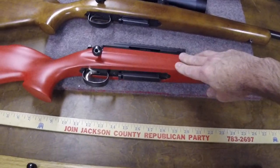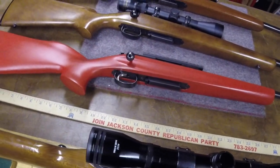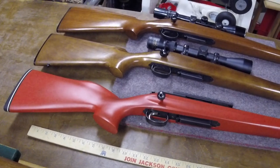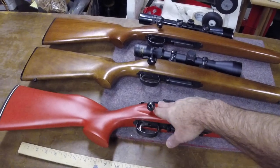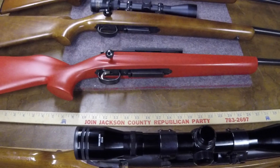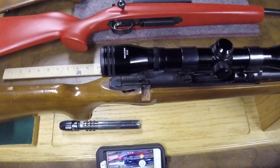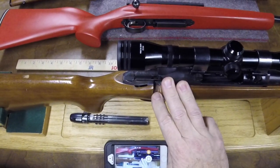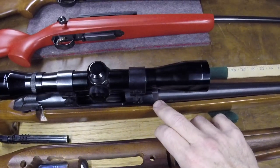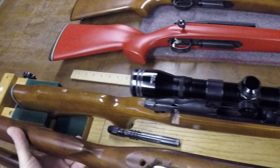I always figured I would carve on this stock a little more — thought about putting a flat bag rider on the front and maybe changing the shape back to make it ride in the bags better. I looked at several alternatives for aftermarket stocks and didn't find anything I really liked. I was pretty much of the opinion that I would buy a Remington 700 stock without the action inlet — just with the action channel and barrel channel cut — and then do the rest of the inletting to fit the 788. The tube is more or less the same, though the trigger group, bolt, and all that is different. But I came across these surplus stocks at a fair price so I bought a couple. I'll probably see how the 6mm fits and put some bedding on the recoil lug. 788s have a relatively heavy recoil lug on the front of the receiver, similar to a 700, actually even a little heavier.